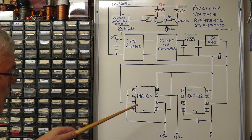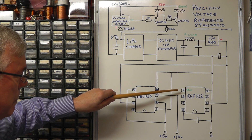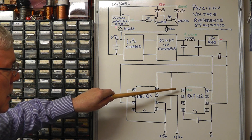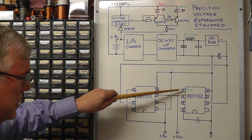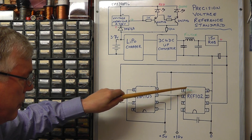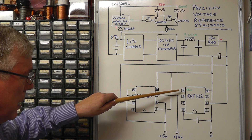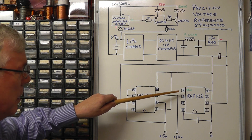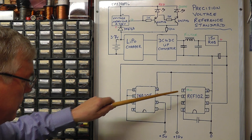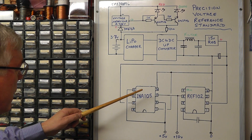The circuit is very very simple. The trim pin is on pin 5 of the reference IC - at the moment we're not using that. I'll show the effects without using it, and then with the addition of two resistors and a trim pot you can trim this IC to get a much more accurate reference voltage. But with nothing connected to the trim you will have a reference voltage with an error of around plus or minus 0.025 percent. So let's build this up on the breadboard and have a look at how it works.